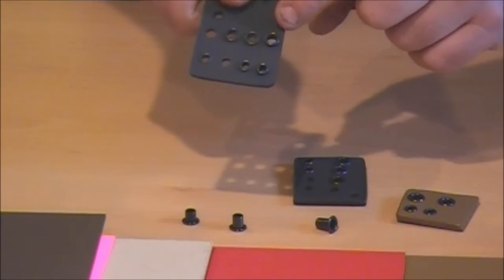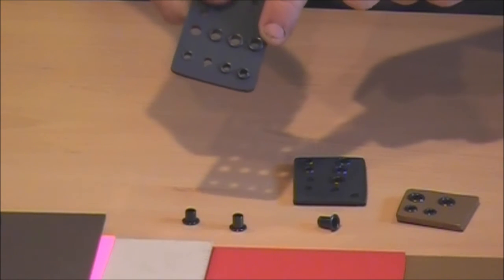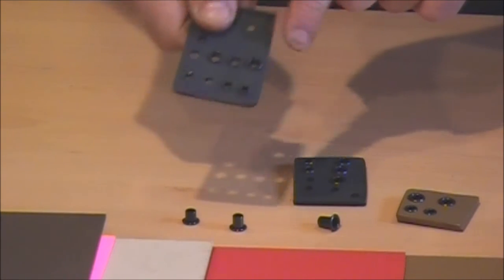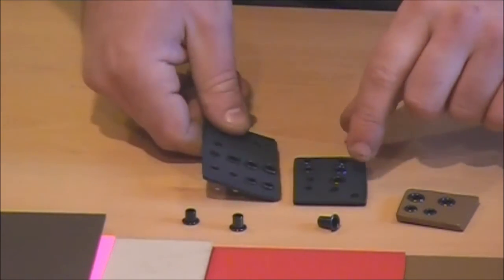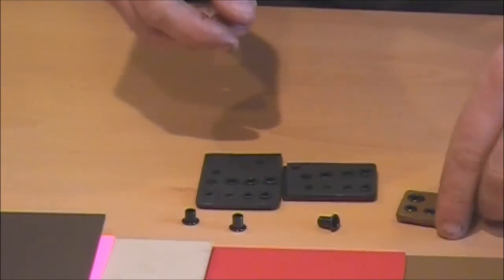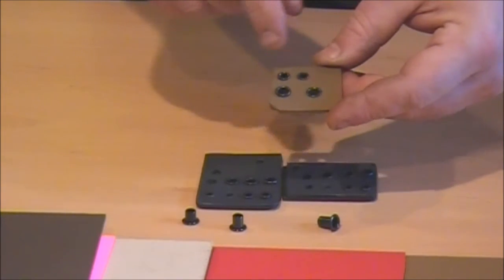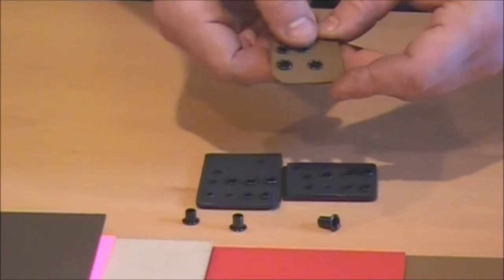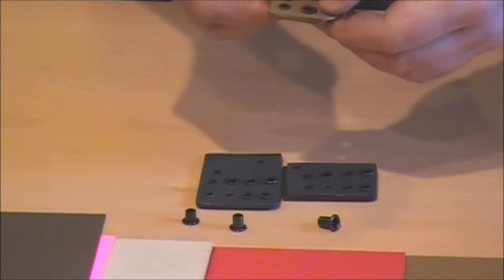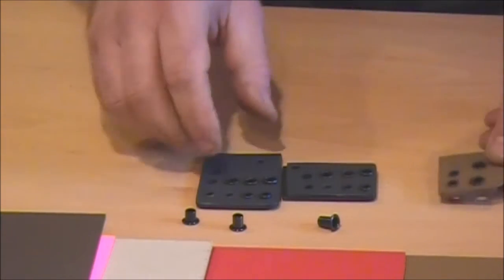However, the thicker or the longer rivets give more roll and give a much more even and better looking form on the back. I'll try and do some close-up pictures so you can see these. So I've got all the rivets, got through all the thicknesses, and you can see the differences. Again, in the 93 I've only got two sizes that will fit, which is the extra long ones and the 93 ones specifically. And again, especially on this one, the 125 rivets give a much nicer roll.